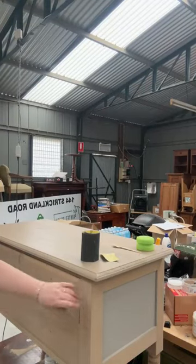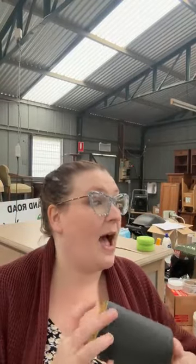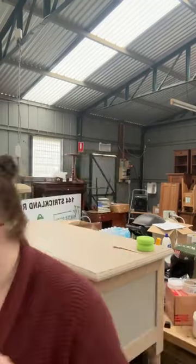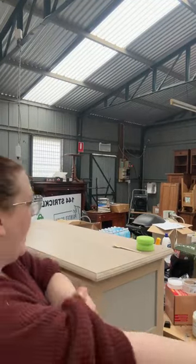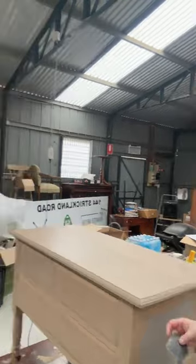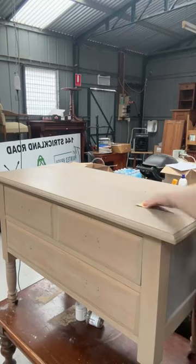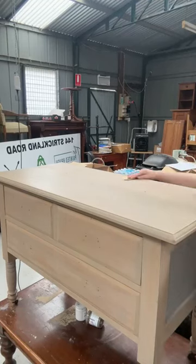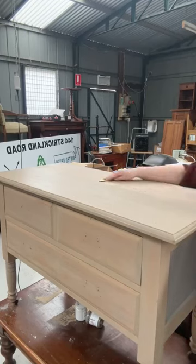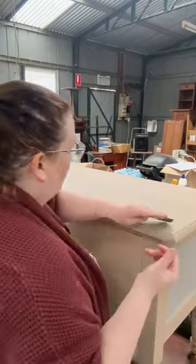Before your second coat, I've already done the body of this piece — I'm going to quickly sand over the drawers and the top. You're going to get yourself some really, really fine sandpaper. I've got 1,200 grit. We now stock this. I had about 10 rolls a couple of days ago and they've flown out the door. Beautiful sandpaper — really good quality and it just keeps going. All you're going to do is let your sandpaper do the work — just really, really lightly sand over. It's not really a big deal if you miss bits. We just want to get an overall quick light sand all over. This is what's going to help achieve that baby-bottom smooth finish.